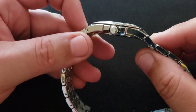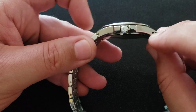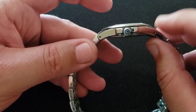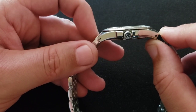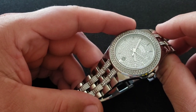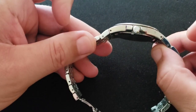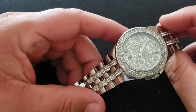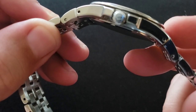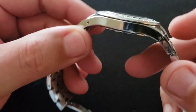This is a very weird design for a watch. Here you can see the hole. I've never seen another watch like this — like with Invicta, if they don't use spring pins, normally it's a bar that has a screw end on it, and that holds the case to the bracelet. But this one here actually uses roll pins or cotter pins. This is very different.